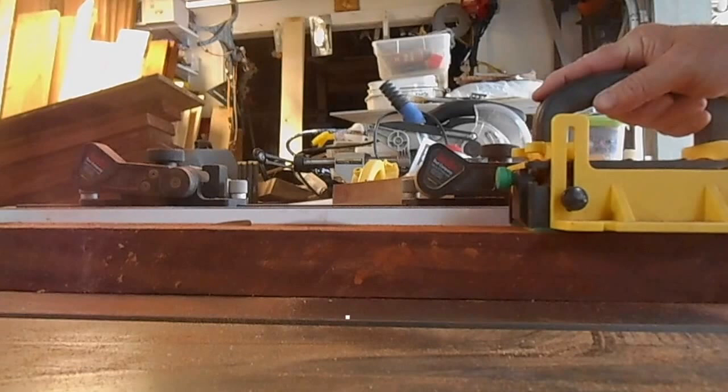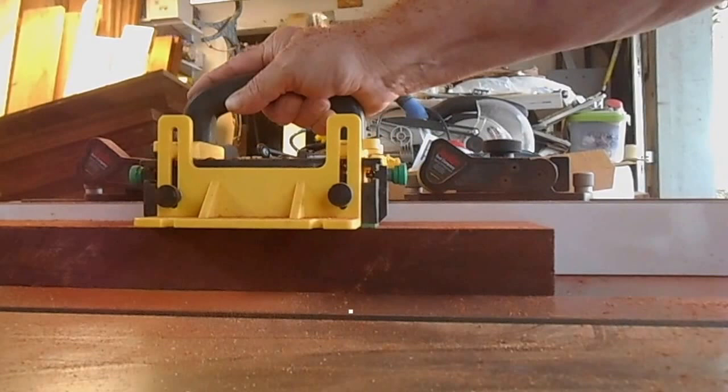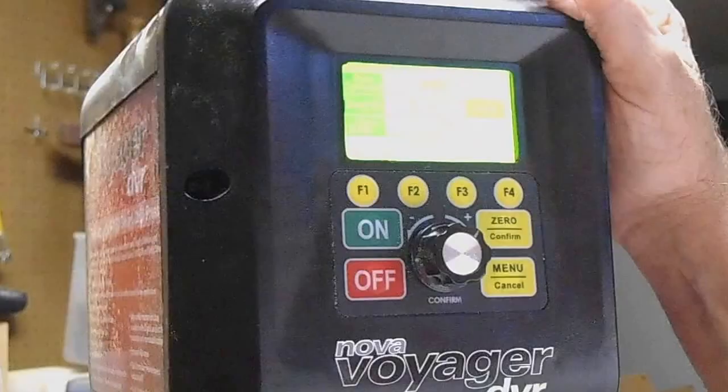What I'm doing is taking some six-quarter mahogany stock and cutting it into strips so that I end up with a cross section. I made maybe five or six and cut them down to about two feet in length. The object was to make an upper part of the walking stick with a header on it that would have a bottom section that screws into it, adjusted for the particular height of the person.